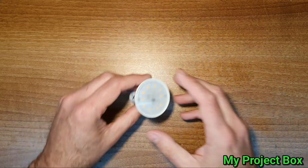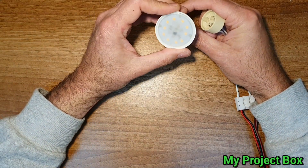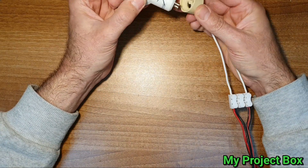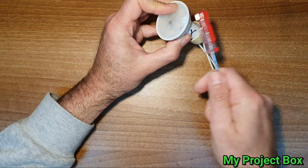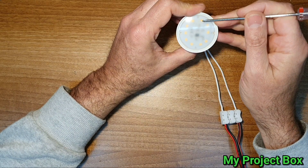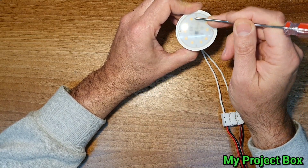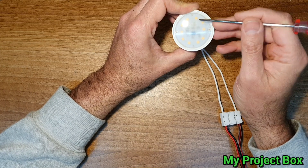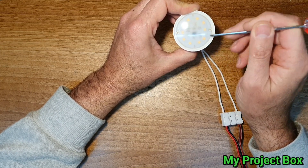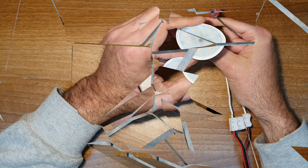So let's see what's wrong with it for a start. First thing we need to do is plug it in and see if it lights up, because this used to light up intermittently. So that could just be a loose connection. At the moment it's not working. You could tap it a bit and see if it starts working. Normally you can see on these LEDs in the front if one of them starts to darken - sometimes under thermal stress it'll flash or come on and off. They're all connected in series in these cheap bulbs, so normally you can see one LED is darkened.